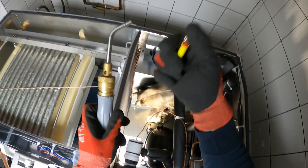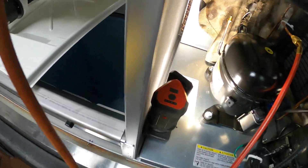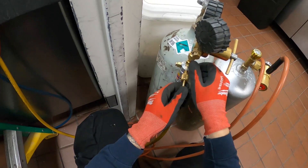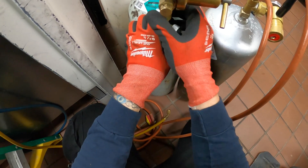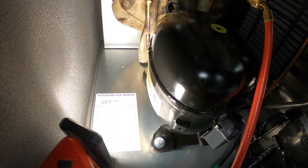Smoke alarms are off. I don't have my striker with me. Close our manifold. I'll let it purge out a little bit through there. Close nitrogen tank. Close this. I'm gonna take out this little regulator — I believe I got it already. And I'm gonna connect it like this. Once that pipe cools off we're gonna put the Schrader valve back in place, pressurize and test for leaks.